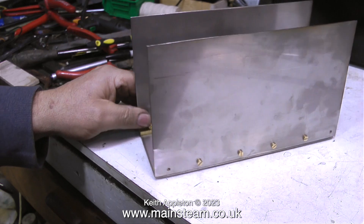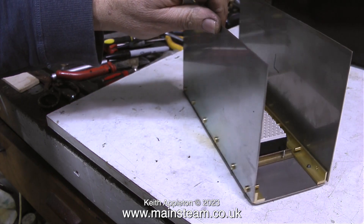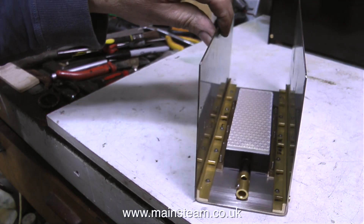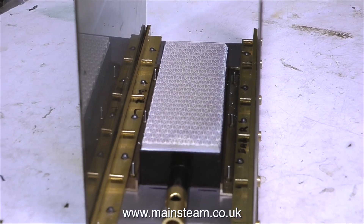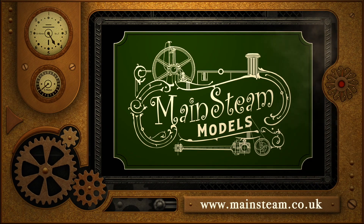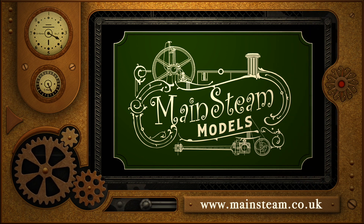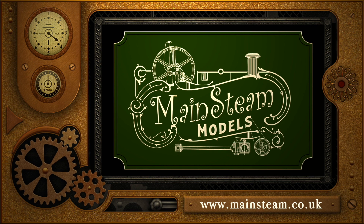I would however like to take this opportunity to say that if you are a beginner to metalwork in general, you may find that it doesn't quite work out like this, and you may have to use a needle file to elongate the holes in the steel plate to make it fit the holes that you've drilled in the brass angle. And that concludes this episode of Top Tip Time. Stay safe, stay healthy, thanks for watching and I hope you found it useful. Please take the time to visit my main steam models website and click on the section that says 'video playlists' - by doing that you can find other videos that you may like to watch, and by using the playlists you can actually watch the videos back to back.